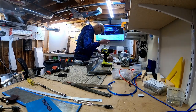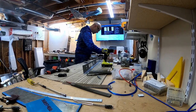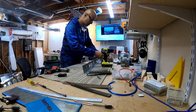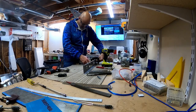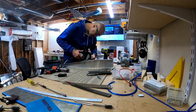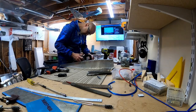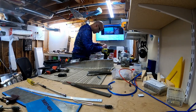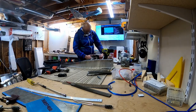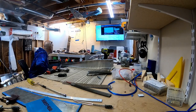I don't know if I didn't properly final drill one of these, but there were a couple holes in each front spar that were really tough to get a rivet through — they weren't really off center or anything. It was just maybe there was some primer buildup or something, and I couldn't get a drill bit in there, so I used my 90 degree angle drill to get in there. It worked out pretty well.